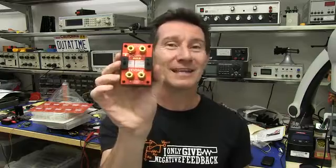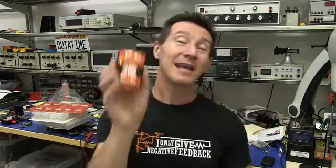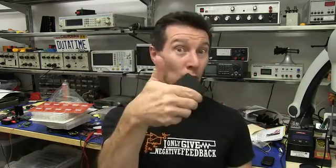That's okay, but what if you're into low-power measurements like really ultra-low-power microcontrollers, wearable electronics, and any sort of circuitry that goes into low-power mode — that can take nanoamps these days. How do you measure that sort of stuff? You can't do it with your regular multimeter. But the MicroCurrent Gold has a nanoamp range, and if you combine it with a 4.5-digit multimeter, it can give you a resolution of 10 picoamps. Awesome!